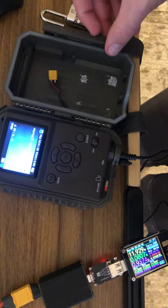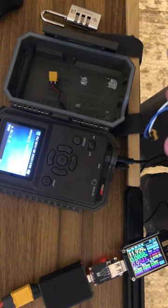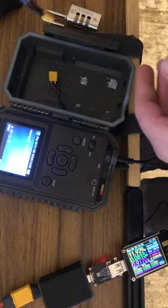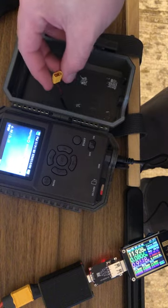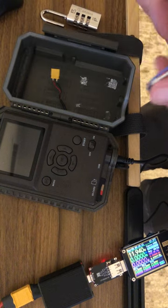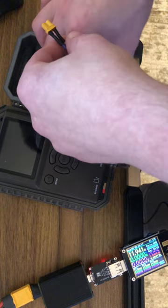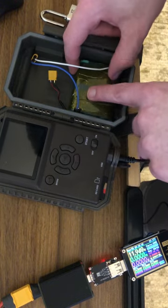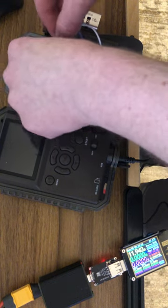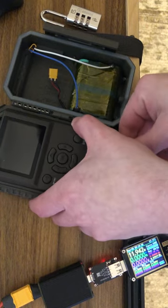Previously I had sticky foam tape down there but I needed to make this safer. All I did was unsolder the wires from the original battery connector and put an XT30 on it. I'll secure that back down once I have shrink wrap on it — it's just a simple plug-and-play. I'll do it right now just to show you it works.